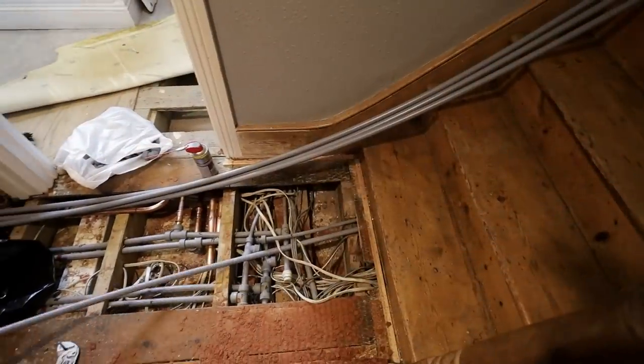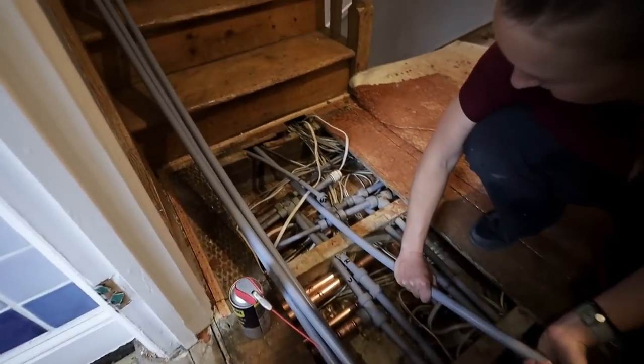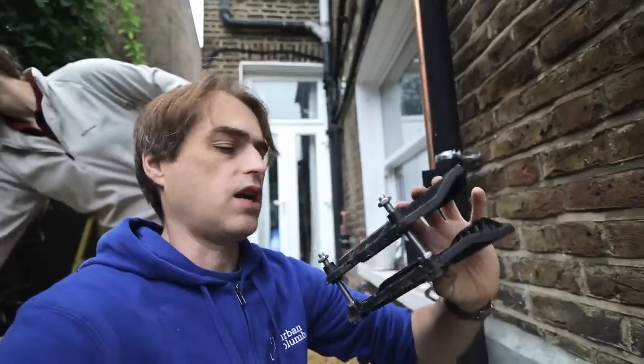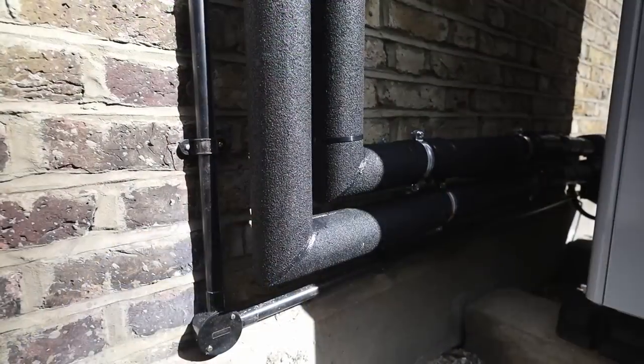This is why we're using a buffer — there's tons of push-fit pipework on the central heating, 15mm polybutylene pipework. I'll be upgrading this pipework going up the stairs as far as practically possible. We need to connect the cylinder and immersion heater so they have hot water, as their cylinder is already gone — we should be able to do it in 50 minutes provided we have no leaks. You can see those pipe clips going over insulation; Marie is cutting it using this tool called the Lager Pro, which gives you really nice mitres. We're sealing all the joints with Bond and Seal from Condens Pro — all this kit works really well and gives a nice, neat finish.